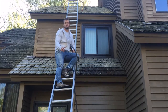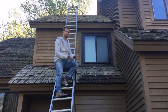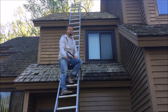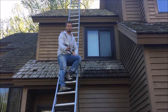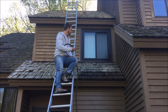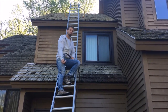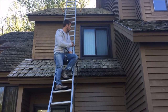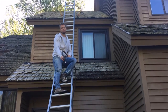You don't want any pressure washing going to your roof — that's not good for cedar shakes. Cedar shakes are very thin and they can become brittle, especially if you're dealing with a roof that is 15 or 20 years old. You want to go with the low pressure process. All you need is a good cleaning solution with the right mix and a low pressure rinse, and that will ensure your roof comes clean, stops the infestations, and extends the life of your cedar roof.